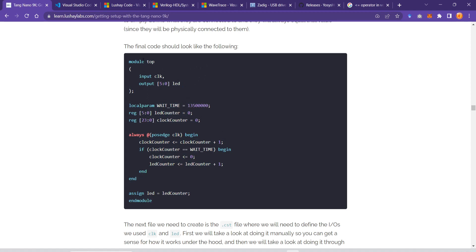This is a fairly long program so let me go through it quickly. We start with module top and we have the input clock and output LEDs — we don't yet define what the clock pin is or what the LEDs are, we just define them and write the program. FPGA programming needs at least two files: one is this programming file and the other is the constraints file where we define the actual hardware connections for the variables we use.